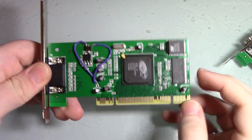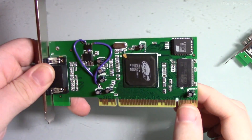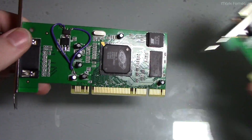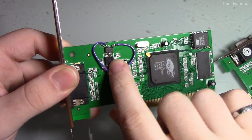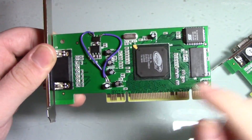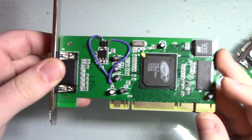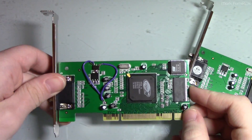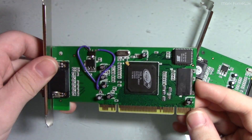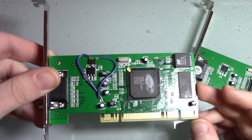So if you have a retro system that has a 5 volt only PCI slot and you need a graphics adapter to make it work, you can totally get these sort of new Rage XL cards — but you're going to have to make this modification, because all of the PCBs have this layout. You can easily spot it: it only has this one big transistor. The original cards will have multiple power transistors for dual voltage regulation. Anyway, I thought this was worth sharing — not because it looks pretty, but because I think it's informative if you happen to buy one of these. It's not actually broken, it just happens that these are 3.3 volt only cards and they don't say that anywhere — there literally is no documentation that comes with these, you just kind of have to figure it out for yourself.